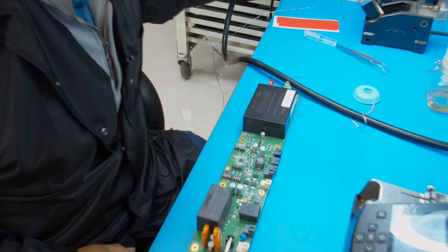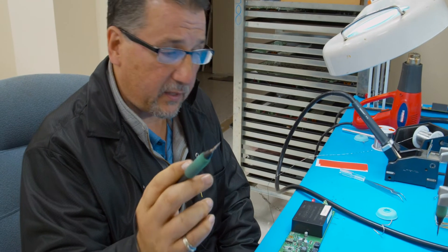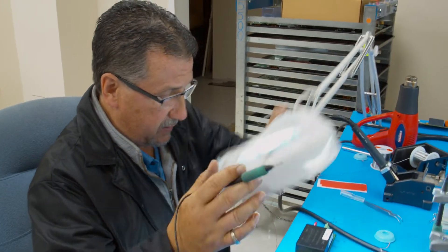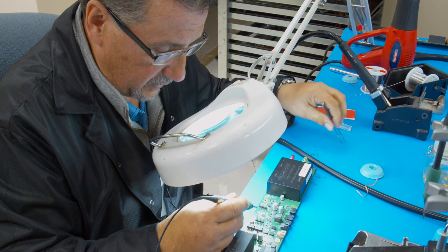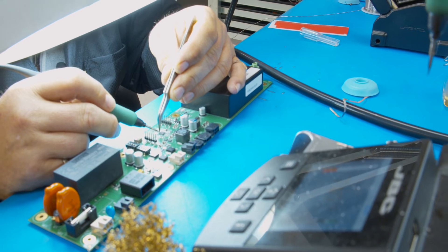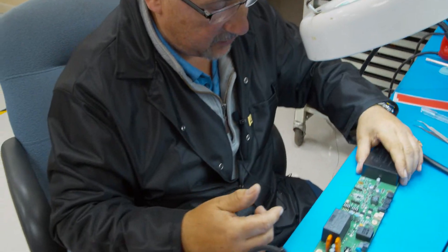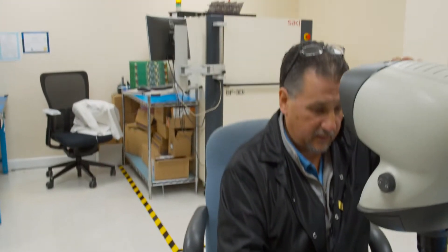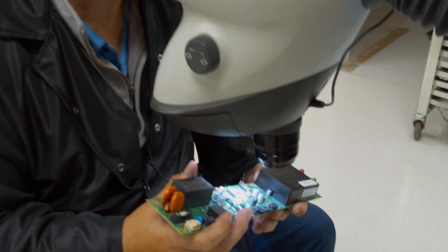This is one of the most important parts — what I will do is tack two legs of the leadless IC. I use a very fine point iron, another JBC iron that I got from QSource, and basically I'm going to tack both sides of the leadless IC. I tack one leg and then I tack another leg. Then you want to bring it over to your microscope or mantis and make sure that it's lined up perfectly, because it's going to go down wherever you have it lined up. I can check and see that it's perfectly lined up.